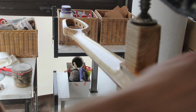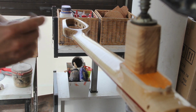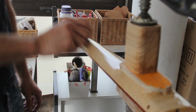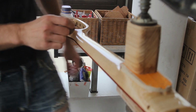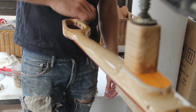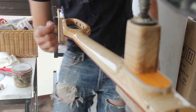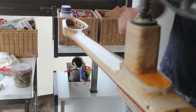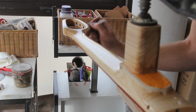I feel now that the surface is getting quite tacky, and that's a sign to ease off with the shellac and only put a drop of oil on the pad, and now I'm gonna polish out what's on there. Then I'm gonna wait a couple of hours until the coat has dried, and then I'll apply another one.